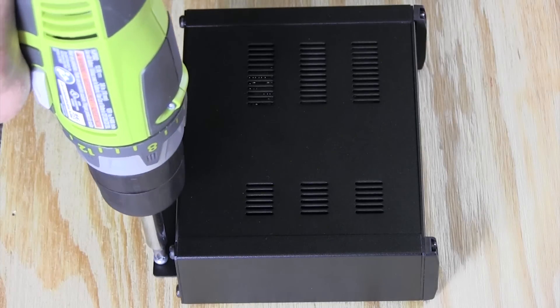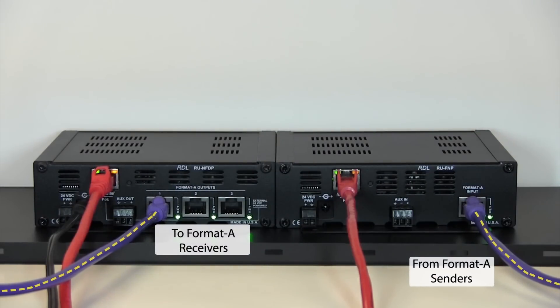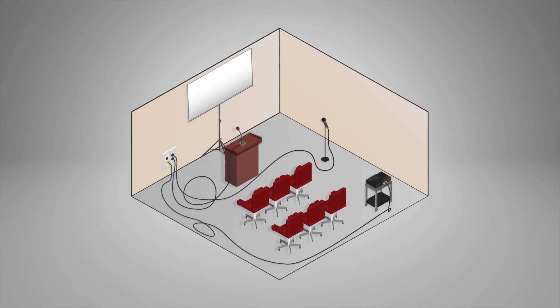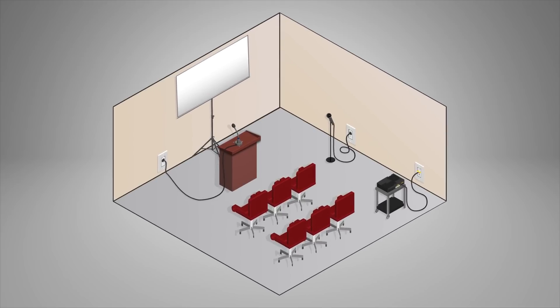This backboard or rack-mounted device converts up to three audio sources from Format-A mic or line senders to a Dante network, converts up to three Dante audio channels to endpoint destinations equipped with Format-A receivers, or both. Rather than clustering input and output connectors in one wall box, Format-A endpoints used with an RDL Dante interface can be put right where they are needed.